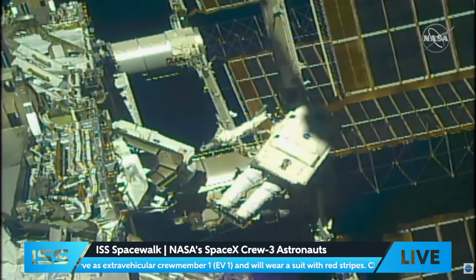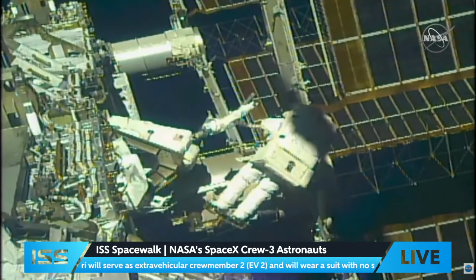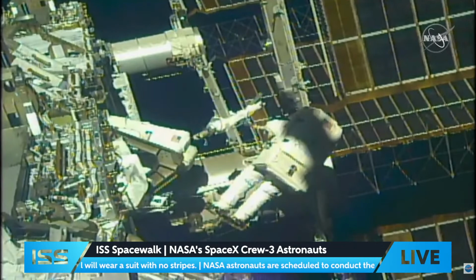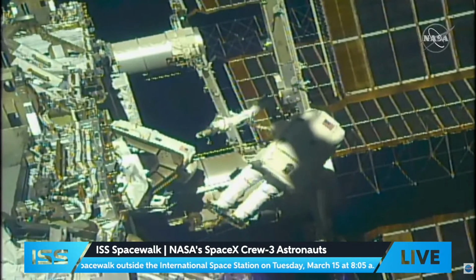M22, I had 6.9 turns, good green light, 12.0, and black line flush, but from the parallax here, with the mirror, it's flush, maybe a half millimeter. I can try hitting it again. Okay, 6.9 for a total of 8.9 turns, green light, and you're saying a half millimeter between the black line? Yeah, it looks like more from my angle, but when I put the mirror up to it, I'd say half millimeter at max. I'm trying to get a straight on look at it. That's a good M22, Roger.